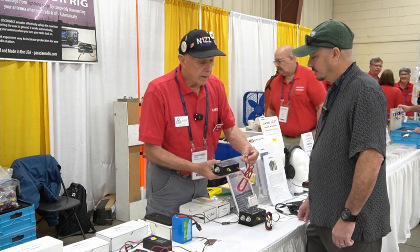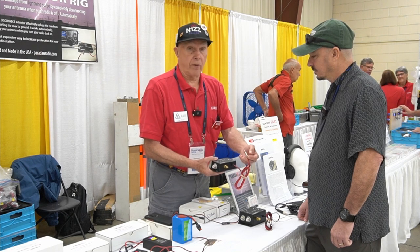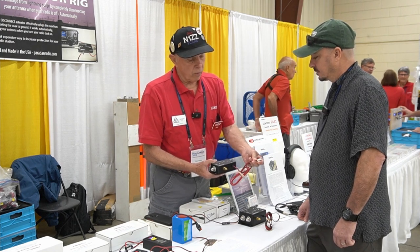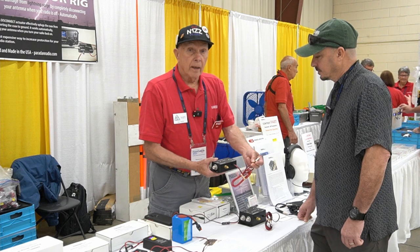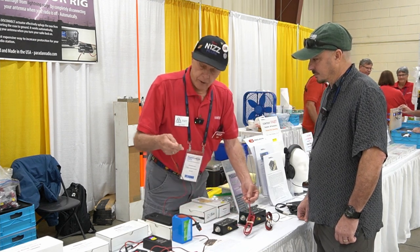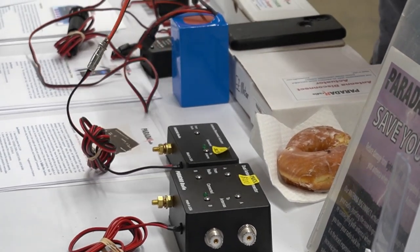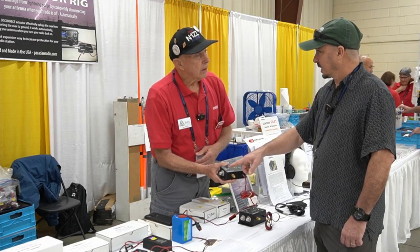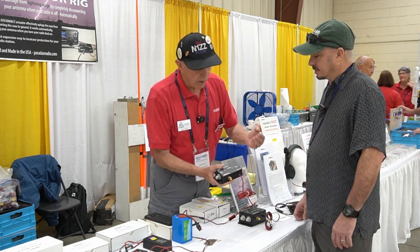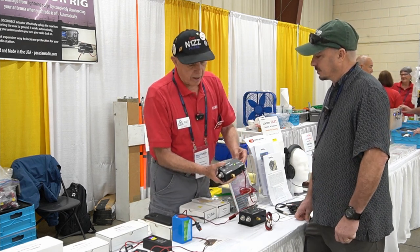This powers it — it turns the relays on. How do you do that? You just connect this to the back of a modern radio's 12-volt jack. Most radios have that. You can connect it via this RCA connector, or cut the wires off and put them on your power supply. When you turn either one of those on — I'm going to demonstrate that right now — plug it in and it turns the relays on and connects you up. So now I've got a path from the radio side out to the antenna, and it's disconnected from the ground. Well, not exactly — the ground is still on the shield. So the shield is grounded, but the center conductor is now connected all the way through.